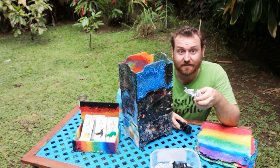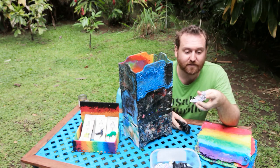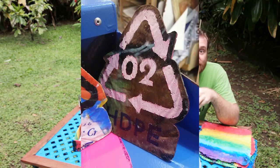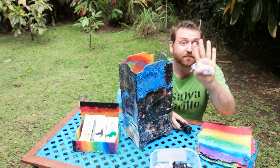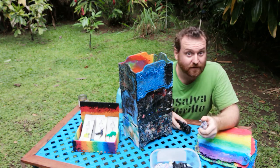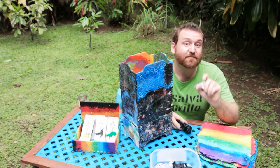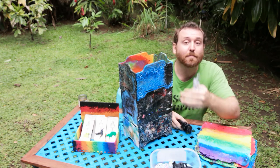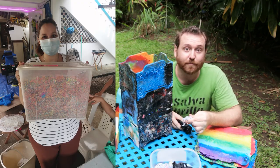Other types of plastic you can safely remelt include plastic number two, which is HDPE; plastic number four, which is LDPE; plastic number five, which is polypropylene; and then some 3D printing types of old filaments. We try not to use ABS because you can't really laser cut it.